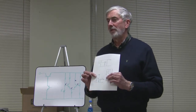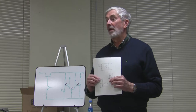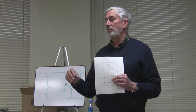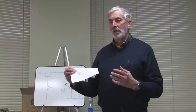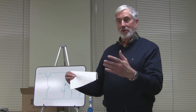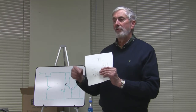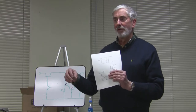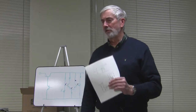I've drawn this in typical fashion for an NPN transistor. On an NPN, it takes plus voltage to make it go, and it takes plus current on the base — called forward bias — to make it conduct. When you go to measure the voltage on an NPN transistor, there will be a large voltage, like 12 volts or more — in this case 30 — on the collector, and the base voltage is held at 15 volts on the original design. They had a 15 volt zener.